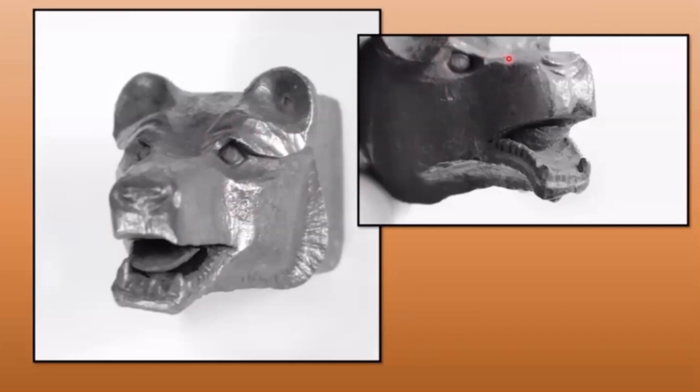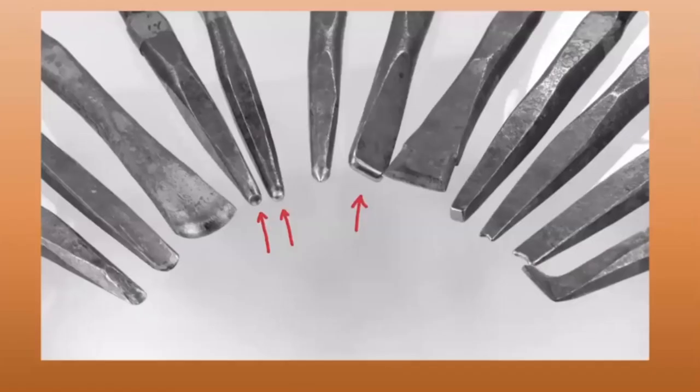I'm going to use three tools. I've got my fuller just to sort of re-establish the eye socket, if you will. I have got a ball. This is a bob punch, and that bob punch is the same size as the fuller. And I use this bob punch to make this eye socket tool or the eye tool. So this bob punch is important to me. One, it makes this tool, and two, it helps me crisp up the eye socket closest to the snout so that I can drop this eye tool in place.